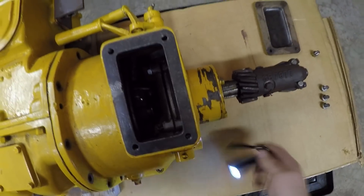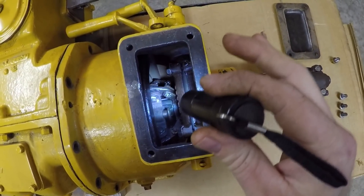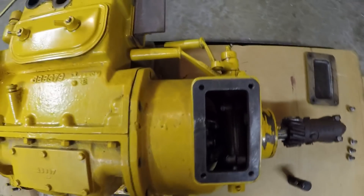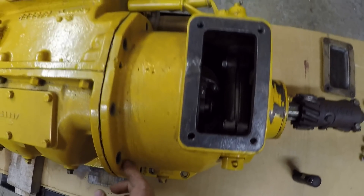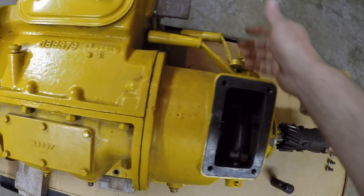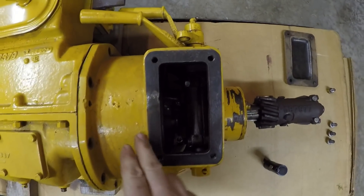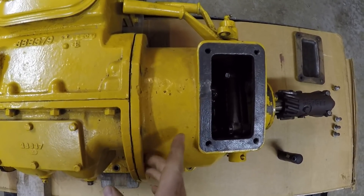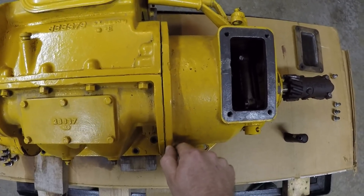Take this little cover off — you can see some of the over-center clutch parts in there. That's where you do a lot of your adjustments. I've already taken all the bolts out to hold the clutch housing to the engine block; really nothing special there, nothing hard to get at. One thing I like to do though is engage the clutch. That's going to hold the clutch disk stationary between the pressure plates for when I remove this. You'll get a better idea why in just a couple minutes.